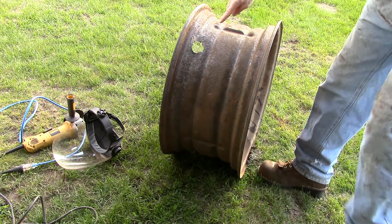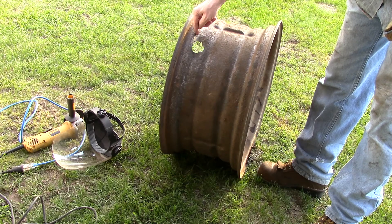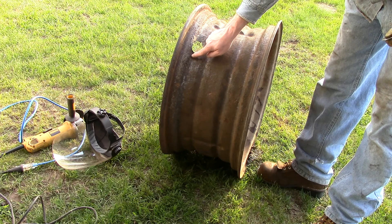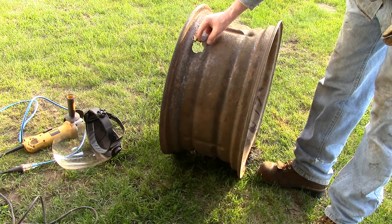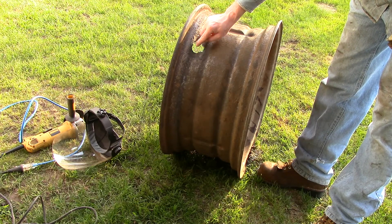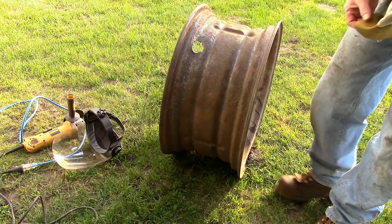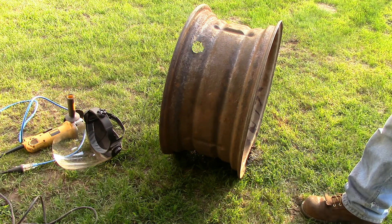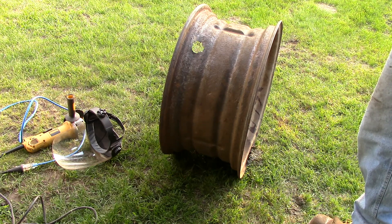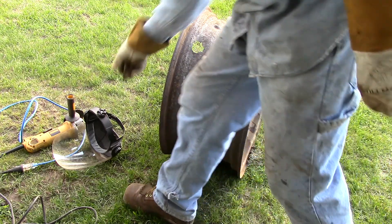Looking at this specific rim, you can see there's a flat surface running across, the pitch goes back this way and then it pitches up this way. So I'm going to make this repair out of two pieces — one is going to be a flat piece of one width and the other one's going to be a flat piece of another width. They're going to intersect at a point and I'm going to fill that up with weld, then on the back side I will grind it smooth. I'll put my earplugs in, my face shield on, and use my grinder with a 45-thousandth thickness cutting wheel to cut this section out.